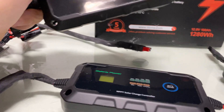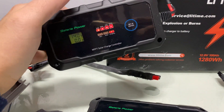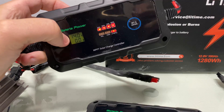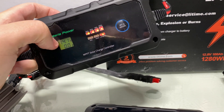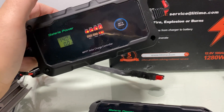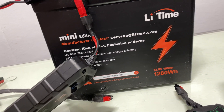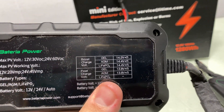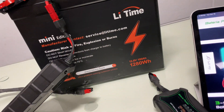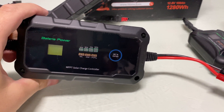I love that it has a screen and a status bar. However, if you watch the voltage, the fully charged battery is like 13.5 volts — it just got finished charging and it's going to drop down to 13.5, but it's still going to be 80 to 100%. It charges the battery at about 14.4 volts to get it charged up, and it can do between 280 and 300 watts.